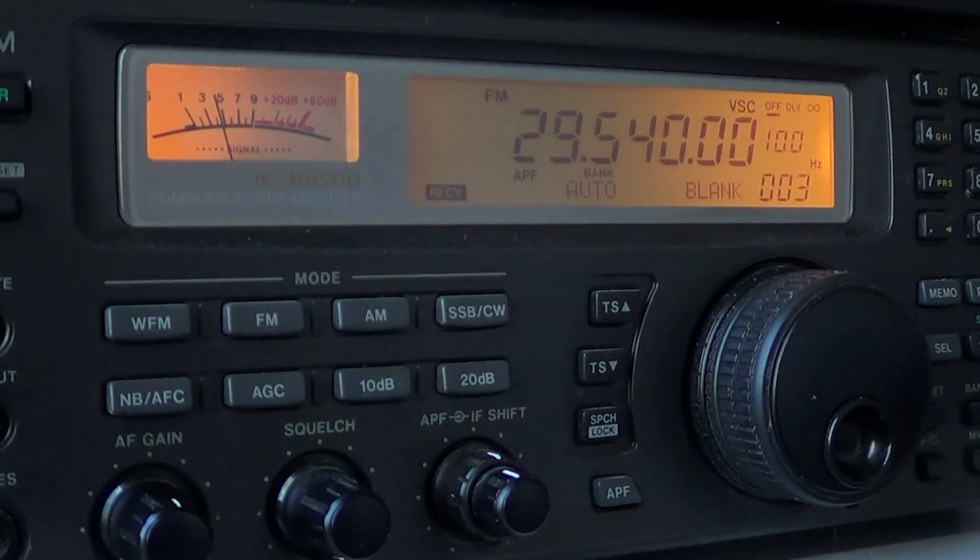It sounds like you're into it really good there. Yeah, the ICOM here is a 9100 — it's one of the Cadillac rigs. There's HF, of course, and we're on 10-meter FM here. Running about 71 watts, about 19 amps here, so it's feeling really good. I have the D-Star module in it; GPS and all that's been tied into it. It has everything pretty much built into it.